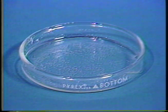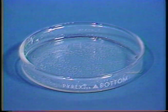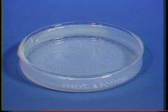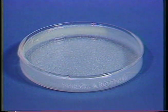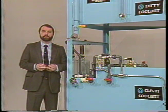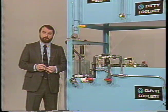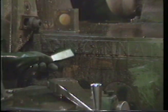Naturally, when the water evaporates, it will leave behind the solids that were in the water. These include the dissolved salts and minerals. After complete evaporation, this is what you see. Mineral buildup in the coolant is a major contributor to residue problems on machine tools. Here's what you see in the real world of residues on machine tools.